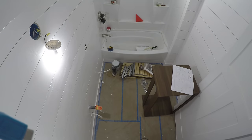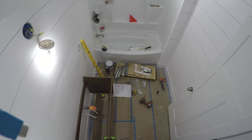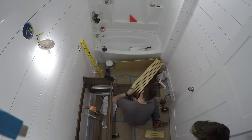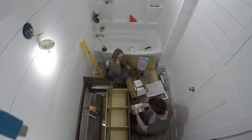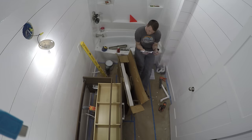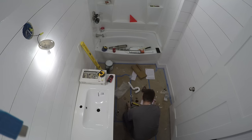Next up we had to assemble and install the vanity and sink — that vanity was actually the fourth or fifth one we bought because we had a hard time finding one that would fit well, big enough for storage but not so large it would intrude on the toilet area. You have to have enough space around the toilet by code. We found one that fits pretty well, assembled it with my daughters helping, got the drawers in, and finally put on the sink top, which is all one solid piece. The shallow drain design gives maximum space inside the drawers underneath.